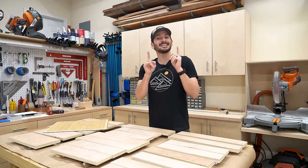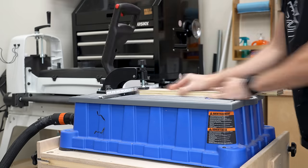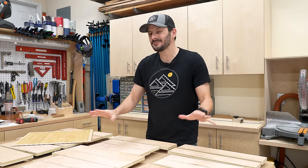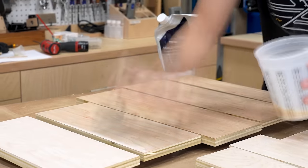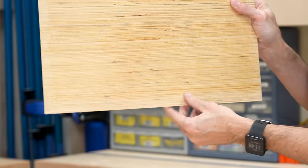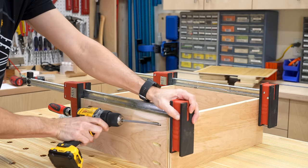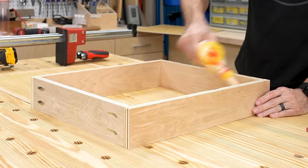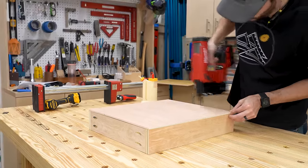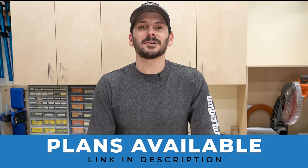I've got all the parts laid out and they're ready for assembly. I decided on doing three drawers — two smaller ones and then a large one on the bottom. I went ahead and cut all the parts on the table saw, did a little bit of joinery over on the foreman, but I did something a little bit different: I pre-finished everything with the varnish. I used a Total Boat Halcyon Clear and put it all over everything including the bottom. I was a little concerned about doing this because it will be glued, but I just left a little strip around there with no finish on it for a wood-to-wood connection. This is going to save me a lot of time and I don't have to get all the goopy mess out of the corners anymore. We do have plans available for the workbench and there's going to be a combo where you can get the storage as well — link down in the description.